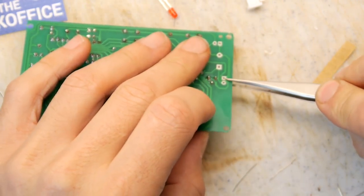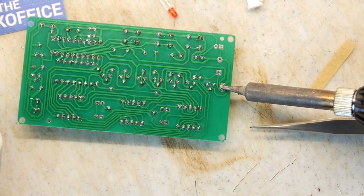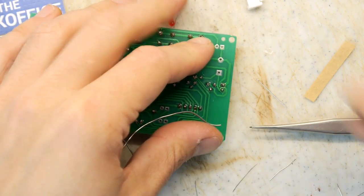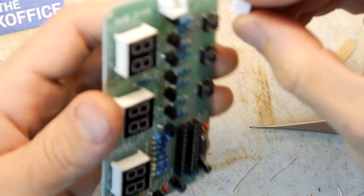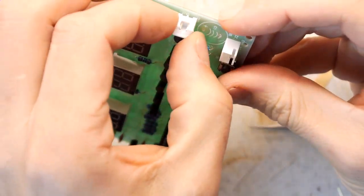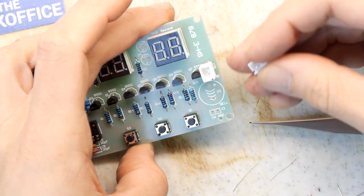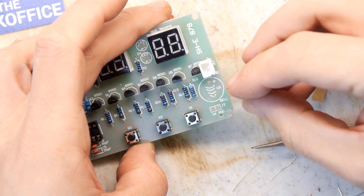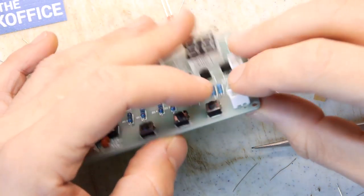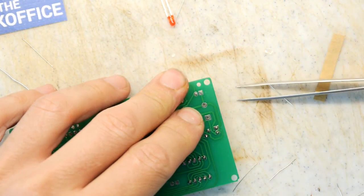It's fascinating, Jim. See what I did there with the tweezers? Got a little bit of a trick technique there to keep this in place while I was getting ready to solder it in. In and ground. Yeah, I'm just looking here. I've chosen ground to be this left one, but on this one it's the other way around. So I'm going to put the connector in this way round so that it's still the same keying. So ground is always on the particular side.